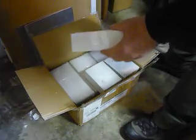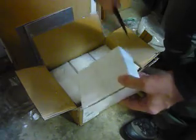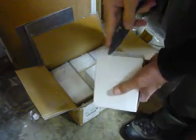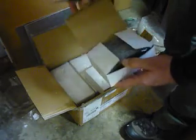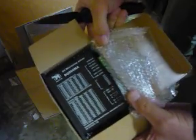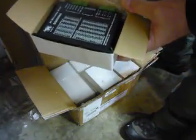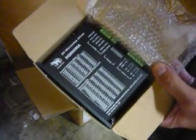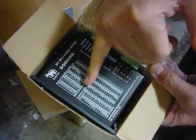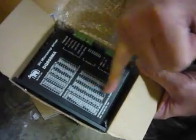I'm guessing these are going to be the stepper motor drivers. I'll put the specs for all this stuff down in the video description so you can see what I got. I'll also put a link to the seller on eBay. There we go — it's a DQ860MA. Typical of a lot of stepper drivers: pulse, direction, enable. You can select from the current table — this one goes anywhere from 2 amps up to 5.6 amps, because I got some pretty beefy 1600 oz-in stepper motors.